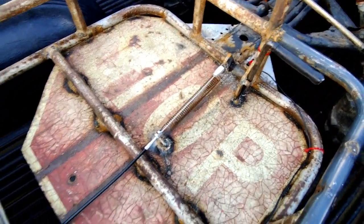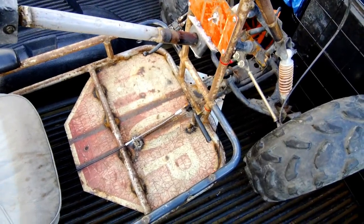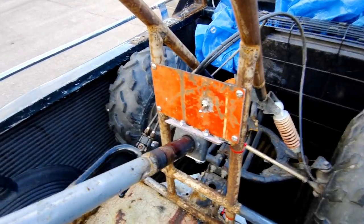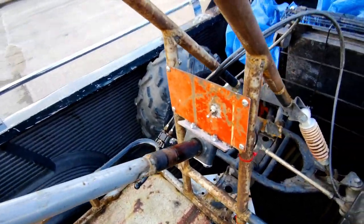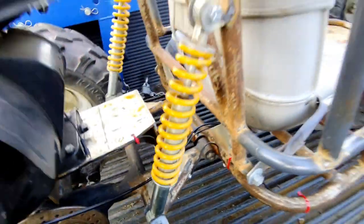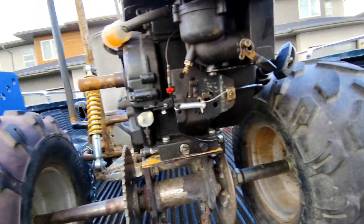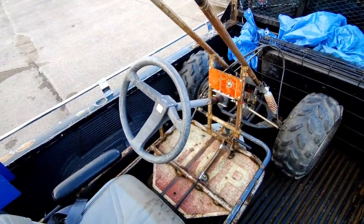I've got a spring down here so it's swinging back — even the leather on the pedal, which I do like. There's something else up here — a little gauge panel I just bolted in. Got an on/off switch to kill the engine — just simple wiring. It runs down and goes along the frame, around, and there's a ground wire in case I want to put lights on. It runs back and hooks to the kill wire.